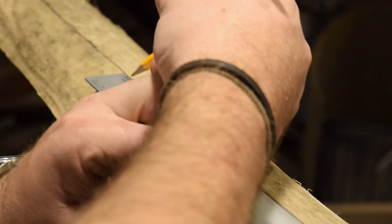There are two different ways that I use this draw knife. One is beveled down, which means that the actual bevel that you can see on the edge is facing down as I'm pulling it. Now what that's doing is actually bringing the angle of the bevel back up toward me, which means it wants to bring the blade back up out of the wood. So that's a little bit less aggressive and more finesse work. If I want to be a little more aggressive, I'll flip it so the bevel is facing up, which means the angle's pushing down, and that'll actually want to draw the blade down into the wood, which would be a more aggressive draw. So I'm pretty close to finishing the profile on both sides of the limbs, getting it down to my drawings that we put on there.